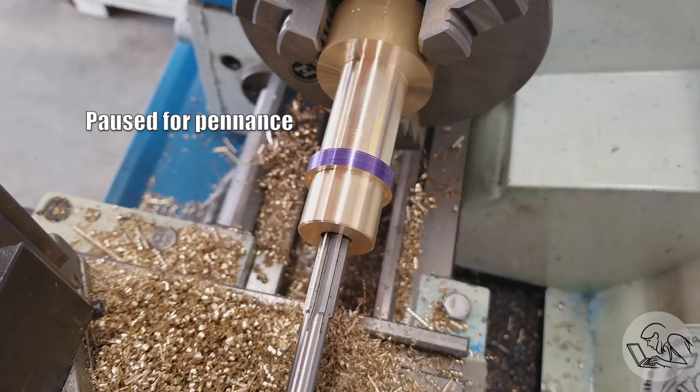Another good option would have been to just drill it a little deeper than necessary and then just go in with a reamer. Reamers can, to some degree, clean up the bottom of a drill cone. If you don't have to make them do too much work, they can cut on their ends a little bit as long as you have the hole a little deeper than necessary.